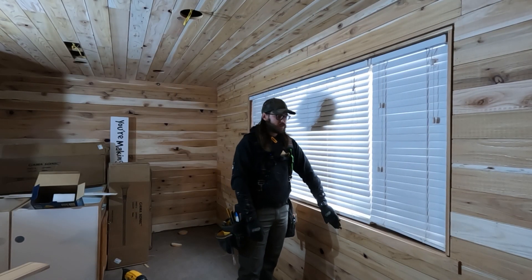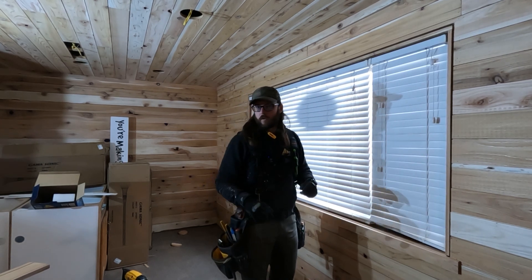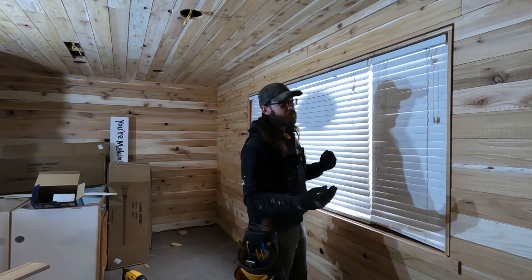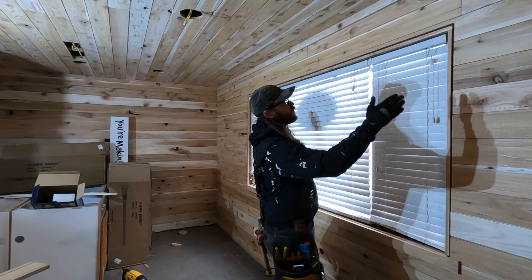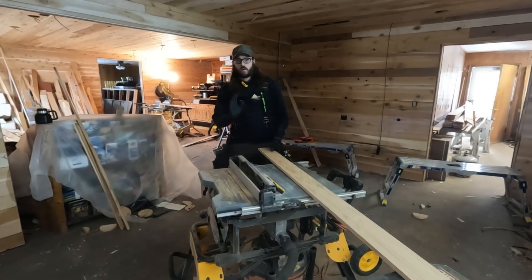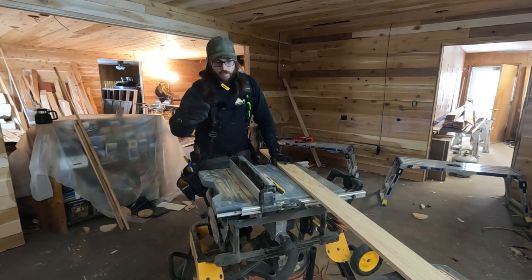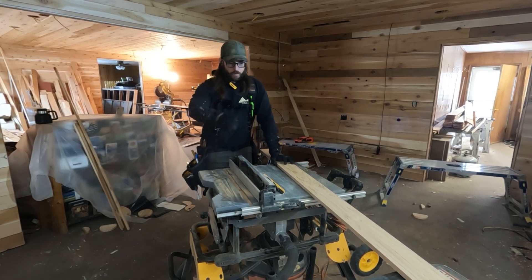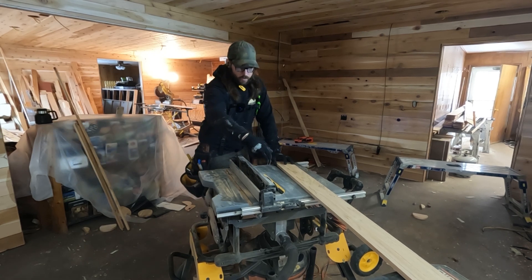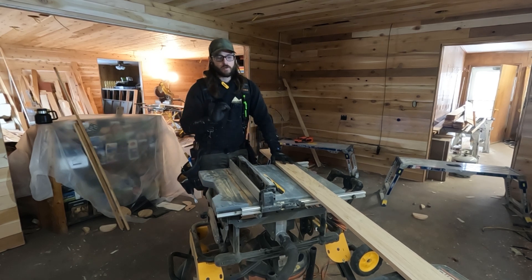Now that our bottom piece is secure we're going to run our top piece. We'll grab more rough stock and rip it down to two and a half inches. I cut it to a rough length of about a hundred and eight inches — plenty long — and I'll trim it to final dimension after ripping. Anytime I'm working inside I try to mitigate dust dispersion as much as possible. I have a regular shop vac hooked up underneath with the hose turned around going into the dust-collection port under the table saw. When I turn on the table saw I turn on the vac and it doesn't completely eliminate the sawdust but it knocks it down by a considerable percentage.